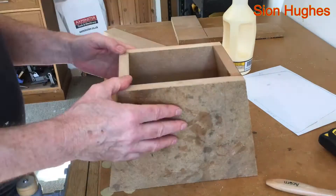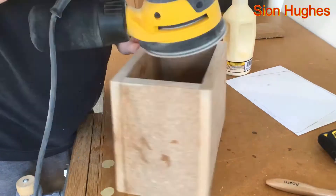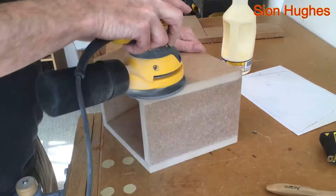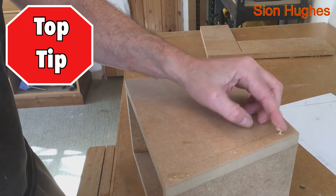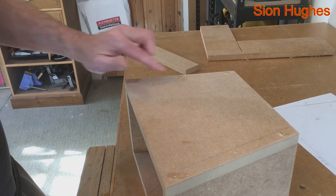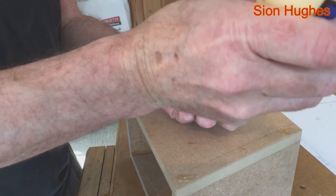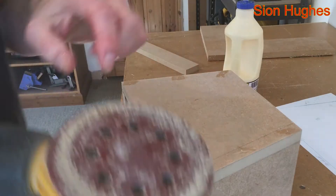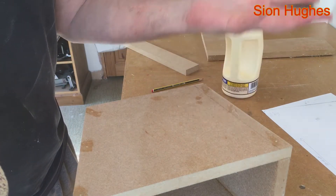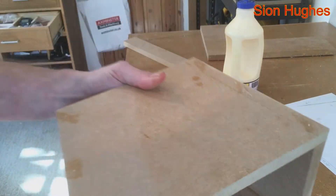I've cleaned off all the glue and the next job is to sand it. MDF, because of how it's manufactured — the face is rolled under very high pressure — once you cut into it becomes quite fibrous, so you want to use a very fine grit like 220 or 240. I'm putting a tiny bit of yellow glue into the nail holes. When I sand over this, the powder generated will fill these holes. Watch — those little holes where the nail gun went in are about to completely disappear.